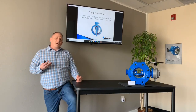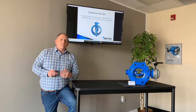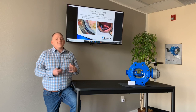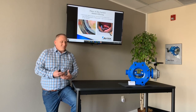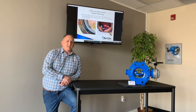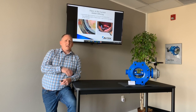Occasionally we get people who tell us that their butterfly valves leak out of the packing glands — we'll talk about that issue in just a moment. But typically when people talk about their valves leaking by, it's due to something like this. We also see that the seats fail over time when it's a seat-in-body design. The seat-in-body design is a good design, but the problem with most seat-in-body design valves is they're throwaway valves — designed so that when that seat goes out, you throw it away and buy a new valve.